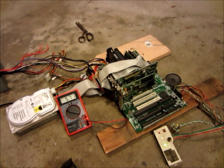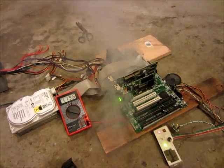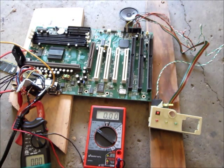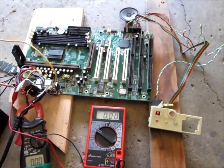It doesn't sound like it's doing too much, I'll just crank it up. There's a little sizzling. The hard drive is groaning a little bit. The Variac just isn't supplying enough amps, and the short-out voltage is about 2 volts, so we should be able to hook it up to a 12-volt battery and we'll see what that does.